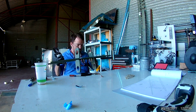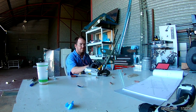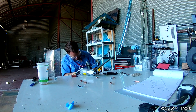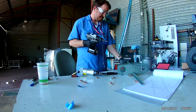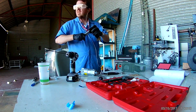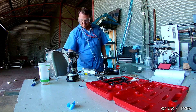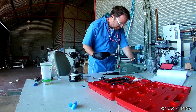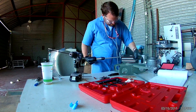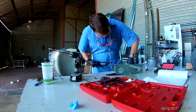Part of putting this together is that the two ribs are at an angle, meaning the easy space to work in between the flanges where the rivets attach the ribs to the webbing does not make it very simple. The big 90-degree bucking bar that I have just won't fit into 70 degrees of space. So there you can see I've got the long one-foot offset rivet set that I'm using.